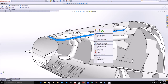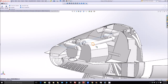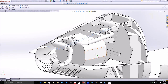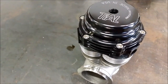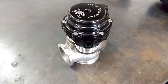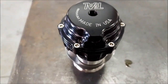I've specifically made the exhaust come out the right side of the aircraft. The reason is that most airports have left traffic — when making left turns, the noise from the exhaust goes up into the air rather than down toward the ground. And as I mentioned in the last video, I had to go over to Mark's shop to solve the problem we had with the Y-pipe and fitting our wastegate. This is the wastegate we're going to be using, and we've figured all that out — you'll see how it fits into place later on.